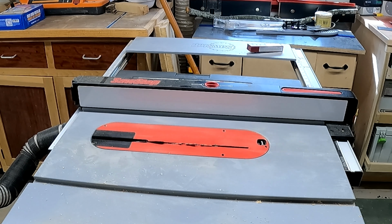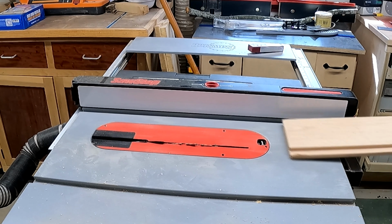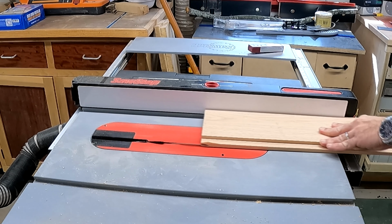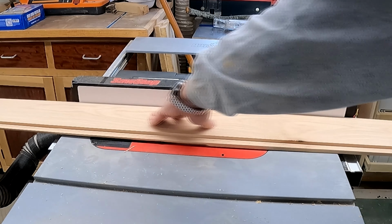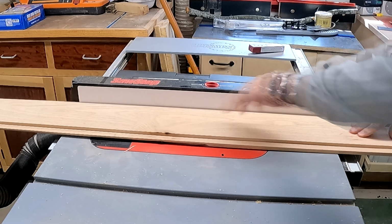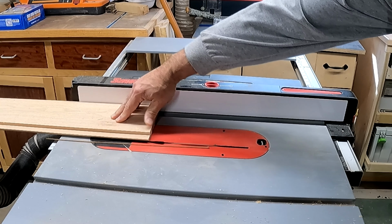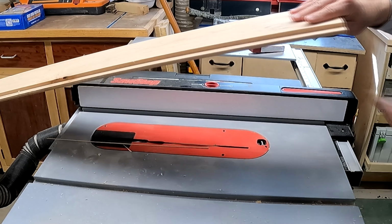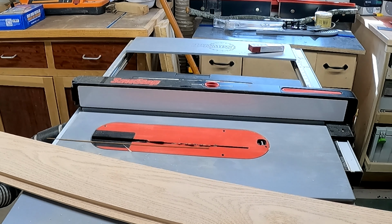What I want to do is put an angle on the front of each board where the boards intersect. So I'm putting a 45-degree bevel cut at the end of the front of the overlapping tongue of the shiplap. I'm going to do the same thing on the inside of the groove of the top side, on the opposite side of this board, in the groove, and that will give us a bevel that faces in when the two boards come together.